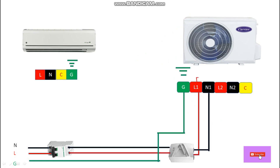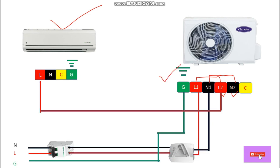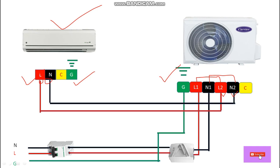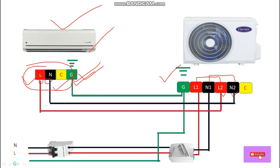At the terminal block, internally this terminal is connected — these terminals are for indoor units. So now we will provide power supply to the indoor unit from this outdoor unit terminal block. Let's take a wire from L2 and it will go to the indoor unit power terminal block at L. From neutral we will also provide and it will go to the neutral terminal block of this indoor unit, and grounding similarly will go to the indoor unit terminal block at the grounding terminal. So up to here the indoor unit also has phase, neutral, and earthing.